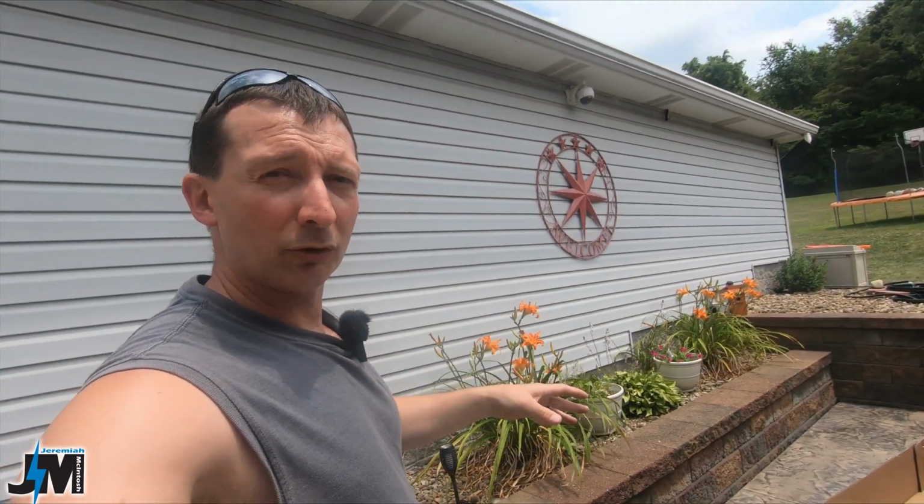And one other thing, I don't think this gazebo has balls on the top, but this first one I put up did. And when we get a heavy rainstorm, those balls drip down through. I think water gets underneath them and drips. So if you get one that has those balls, make sure you put some silicone underneath those balls before you install them onto your roof, because if you don't, more than likely they will drip eventually.